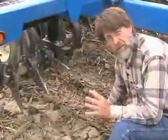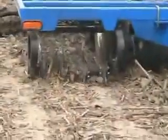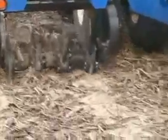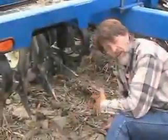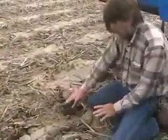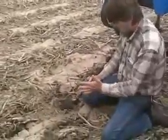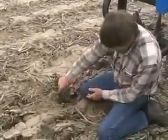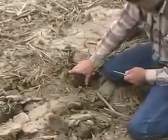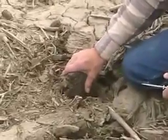Now all of this adds up to, as you see in the action video section, the action of the tine and the soil tillage process actually takes place in front of the center line of the shaft. That's when all the work is taking place. Now you can see here, looking from the opposite side of the machine now, we're looking in from the center line of the tool toward the compression thrust side of the tine. This is the actual result in this fairly elastic plastic clay loam soil of northwestern Ohio.